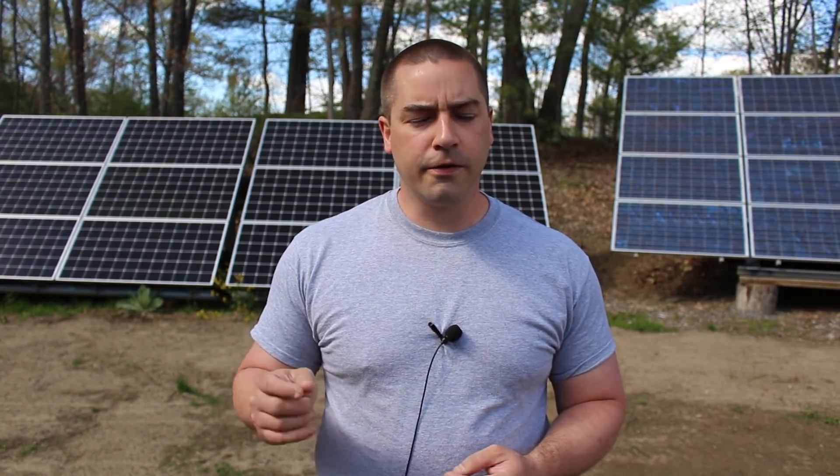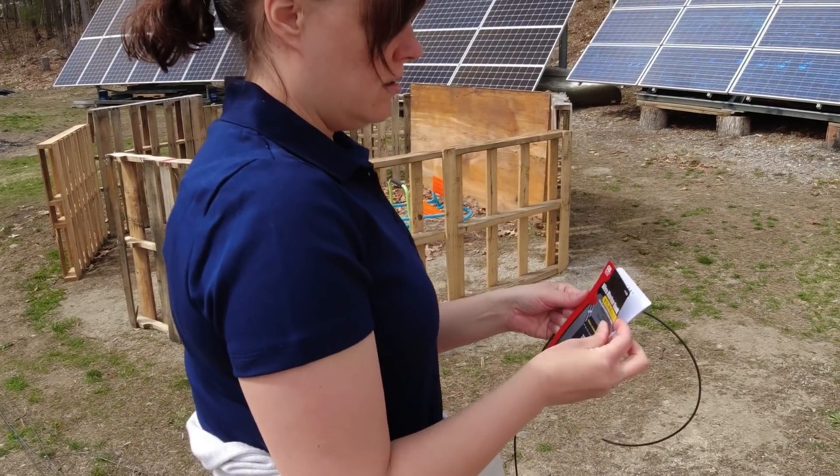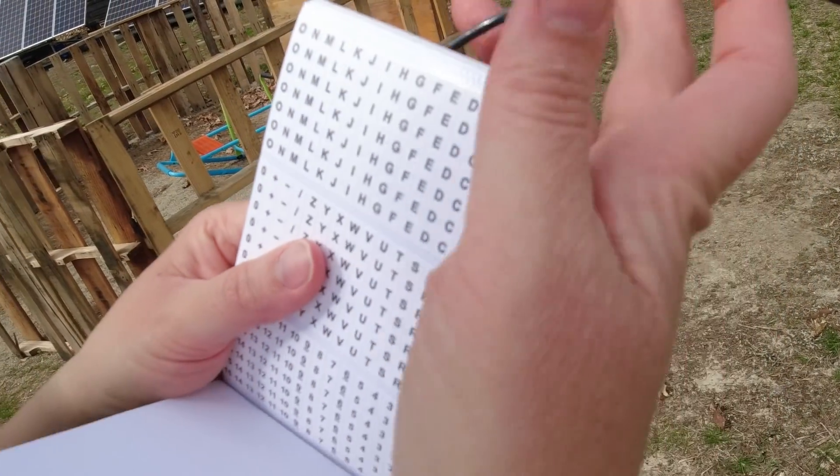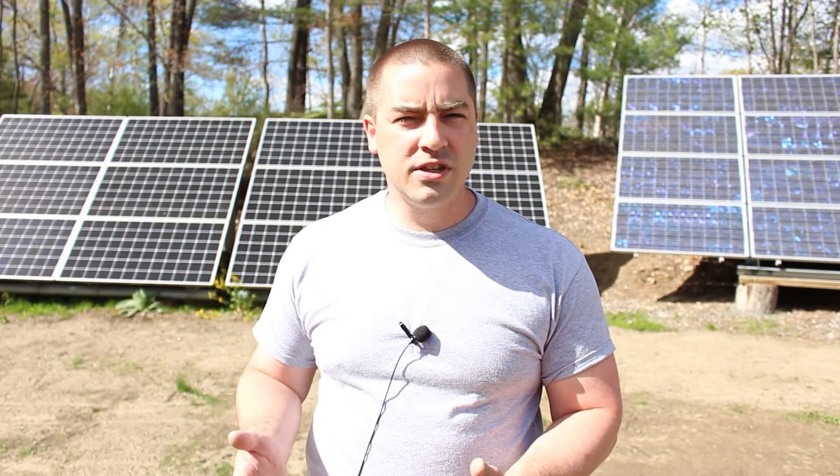All the arrays are going to come together at one point. I'm labeling the individual wires for each string — my wife Elena put letter stickers (A, B, C, etc.) on each end of each wire. I now have six positive wires and six negative wires, plus my original 6 gauge ground wire that runs through the same conduit to a ground rod at the array, which I'm reusing.